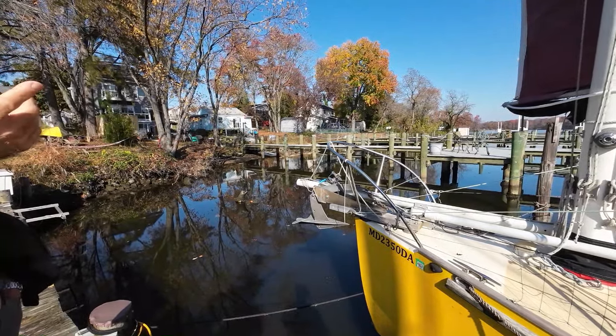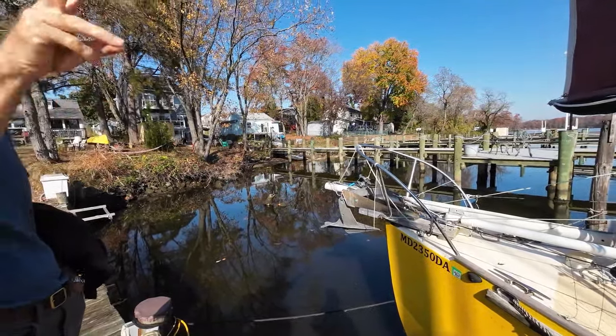The junk rig — we spread 850 square feet on just the two main sails, which means the wind has to get pretty light for us to need the light weather sails. How light would you be looking at to hoist the light weather sails? Generally around six or seven knots apparent is when I'll pull out the asymmetrical. If we're getting eight knots of wind on the beam or forward, we'll easily do four knots boat speed without the asymmetrical. If you put enough sail area up, you often don't need light weather sails with the junk rig — and it's so easily reefed, you can build more area.